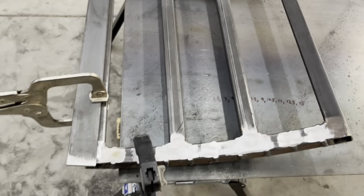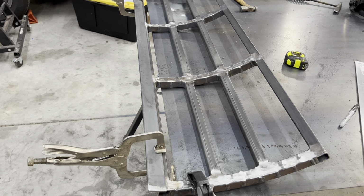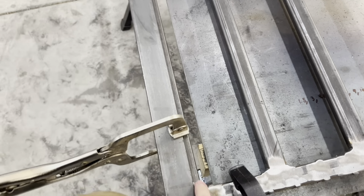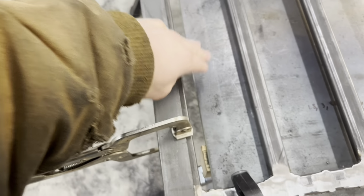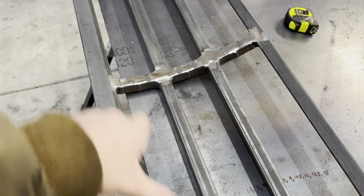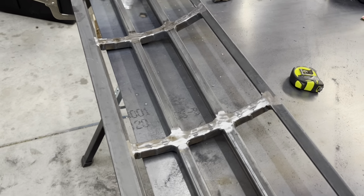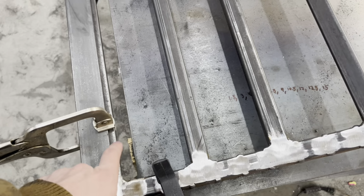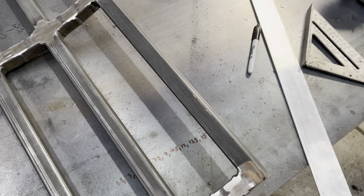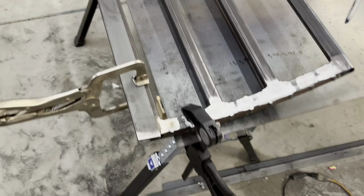But I was thinking about it, and I don't really know when I'd really take that edge off. Plus, when I'm laying that sheet metal down, I kind of need a good edge to start with, as in this edge right along here. Because if I don't have that edge, then I'm just gonna have to tack it on the ends. And what's probably gonna end up happening is I'm gonna break the sheet metal up into different pieces so it's easier to bend all at once, because I don't have a roller. So I think it'd be beneficial to have an edge to weld to start with the sheet metal and just make my way up, because you don't want to go down, you want to go up, and then the extra sheet metal I'll bend over and make it look better.